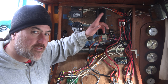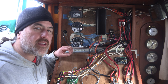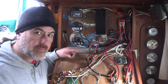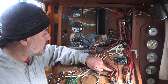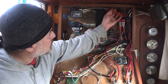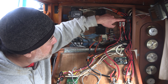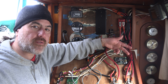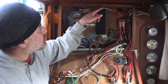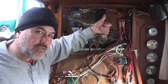Shorting out the D400 is what causes the blades to spin very slowly. Again, the braking switch is not for stopping the D400 for any great length of time — it's just for slowing the blades down so that you can manually secure them by tying a string around them. If the braking switch is in the off position, the flow of electricity goes on to the regulator. From the regulator there are two red cables, each going to a 30-amp fuse, and then from there on to the positive post on each of the house banks. If both house banks are fully charged, the regulator sends excess energy down a cable connected to the dump resistor located in the engine room.